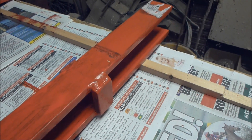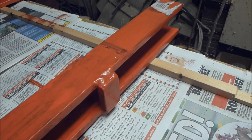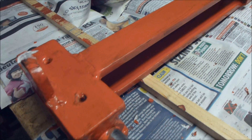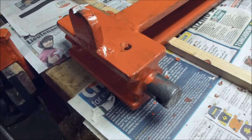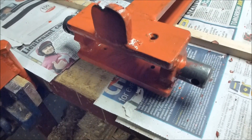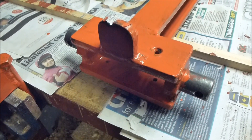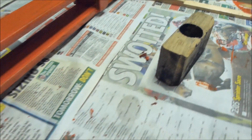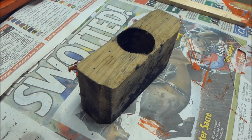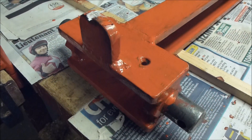I'll call this bit the push rods. This comes up through the bottom of the chamber that you've already seen, pressing up on a loose piston. At the bottom we have this sort of crosshead mechanism with trunnions. There's a wooden block in the centre which guides this over the steel tube. I anticipate that will wear out but it'll be easily replaced.